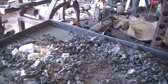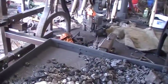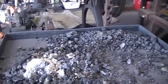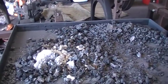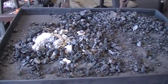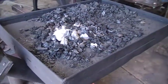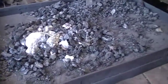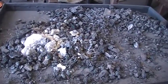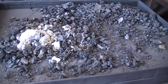Now I'm going to give you the dimensions. That other one — the one that I pulled out of service — was eight by ten by five inches deep. And that's what's suggested as your minimum firebox. Since I was struggling, and I'm learning, this firebox here is 14 inches long, 10 inches wide, and six inches deep. So I went quite a bit more.